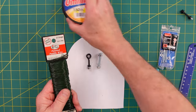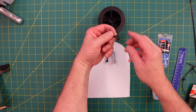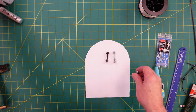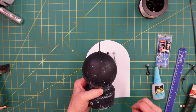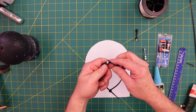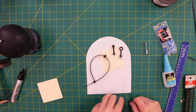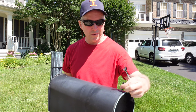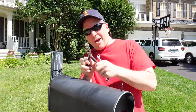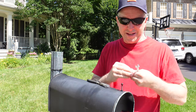I have a metal post in the back. I could make another one of these eyes, make a hole, and screw it in much like I've done on the wooden post, but I'm not sure what height I need. You want to disrupt the perch — not too high and not too low. So I came up with a way using an 11-inch black cable tie with a quarter-inch nut to protect it. Now it's time to take all this stuff outside, install it on the mailbox, and see how it works. I drilled the hole, put this guy in, slid on the sleeve, and made it a little slack so I can adjust it up and down.